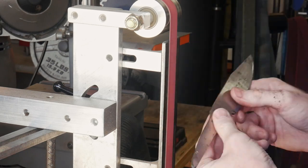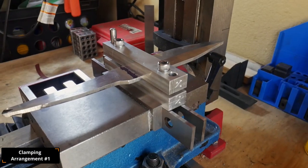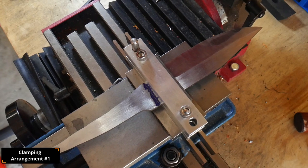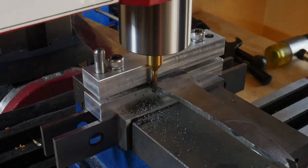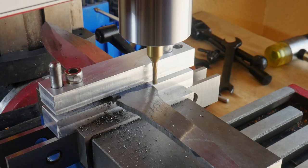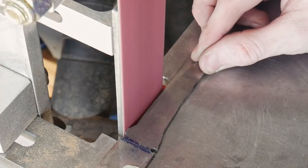On this knife I decided to try and mill in my shoulders opposed to filing them in with a file guide. There's no right or wrong way here — I just wanted to flex the power and precision of my mini mill to get some very precise shoulders. I labeled this clamping arrangement number one because I eventually changed up my clamping jig, feeling my second arrangement would hold it a little bit more secure.